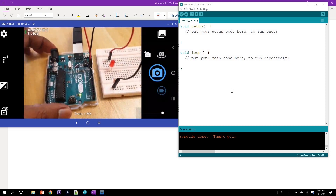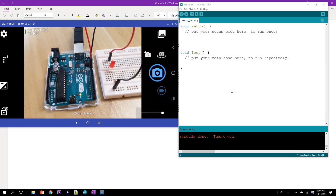First I'm going to show you a quick recap of how you would have probably done this in sketch programming. Since we are driving this LED, the pin has been configured as output — so we will have set pinMode, pin 13 as output. And then in terms of setting it to one or zero, we use the digital write function: digitalWrite 13, HIGH — that is to drive it high or logic one. And then we can have a delay.